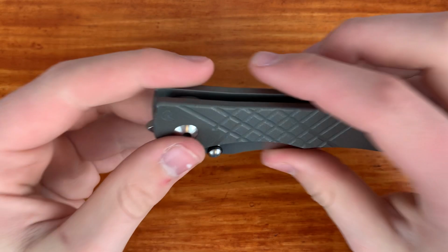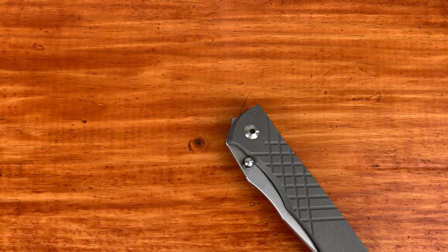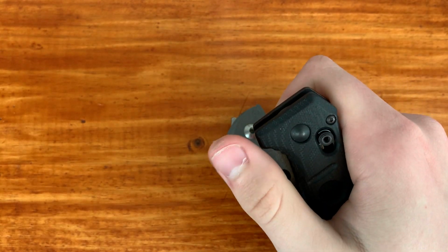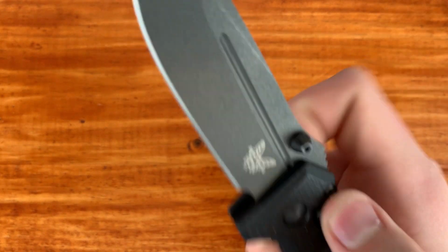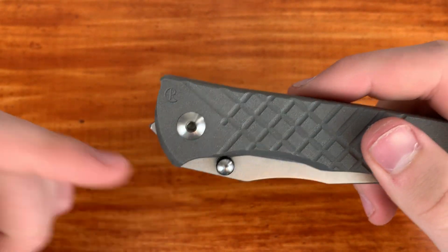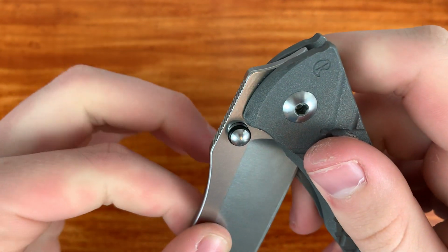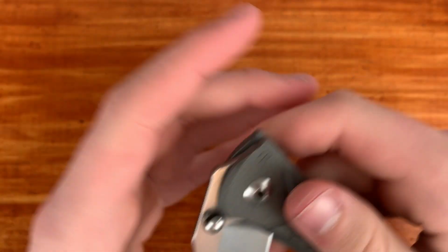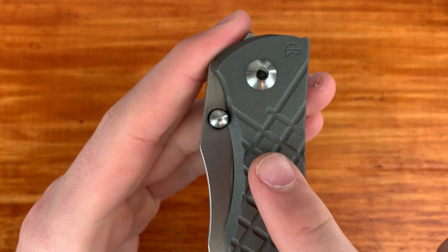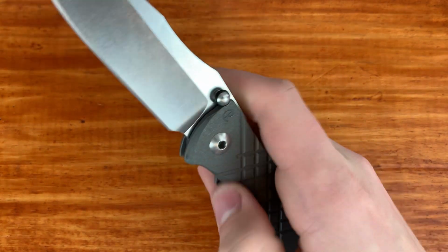And so the Umnumzaan, what makes it different is the kind of path that you have to take with your thumb to deploy the knife. So most thumb stud knives, you're going to take this thumb stud and move it kind of in that direction, like that. That's just usually how you do it. But with the Umnumzaan, if you move it like that, it's a little bit harder, probably because you are having to go around this big pivot here. If you push it like that, it'd probably get pushed out like this, but it's resisting having to get up over this part here, which is, in the end, there isn't enough power behind the flick to get it deployed. So what you need to do is almost flick it in the path that this titanium takes. Not really a straight up flick, but barely angled like this, and it flicks out really nicely.